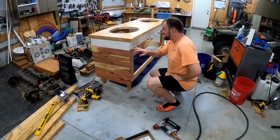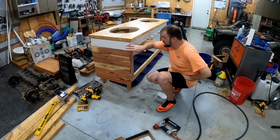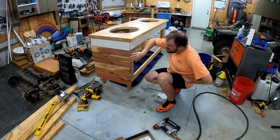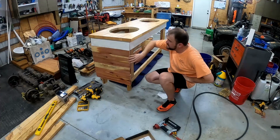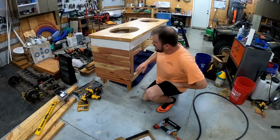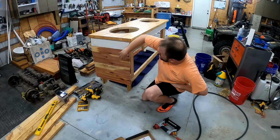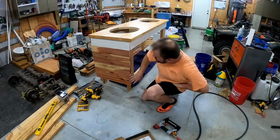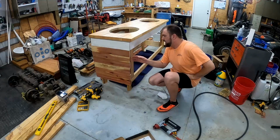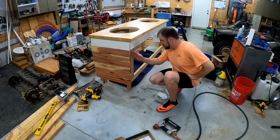Okay, so you can see what we've done here. We've got these 5.5-inch whitewash boards kind of in the middle between the countertop and this rough cut cedar that we're just brad nailing up there, just to kind of break it up. Made a jig. I like the look of all of them looking about the same length, so I pick boards from rough cut, hence the name rough cut. I pick boards that are about the same length or width and do that.